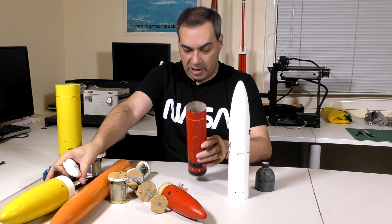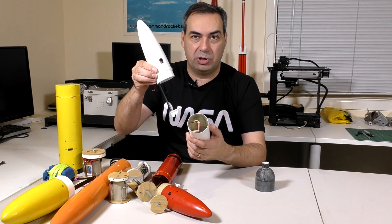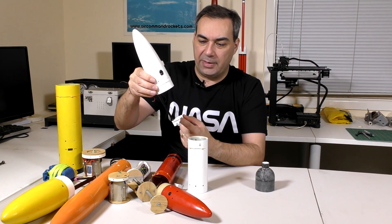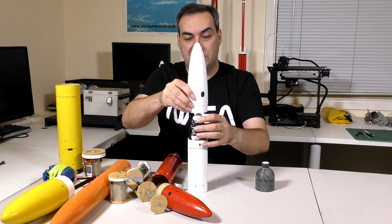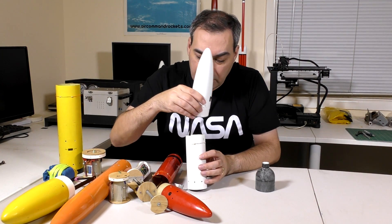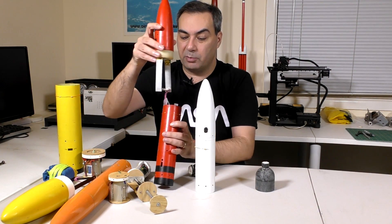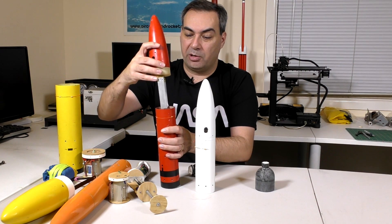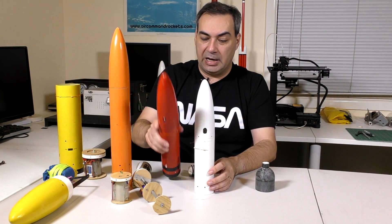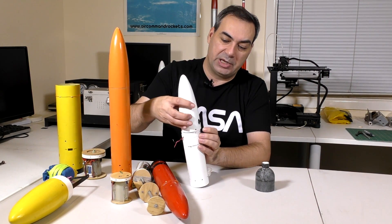So then we went to the Horizon system. The Horizon system still has the same ejection bungee cord inside but there's only one of them, and there's only one leg. The reason for this is the parachute sits in the tube and when it comes out it's free to fall out. One of the driving forces was to try and get it even smaller. Comparing the three mechanisms you can see how much shorter this one is, because we moved all of the electronics from below into the nose cone.